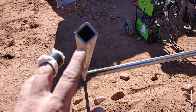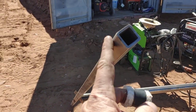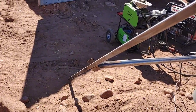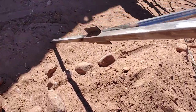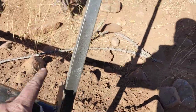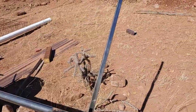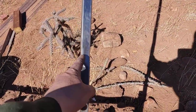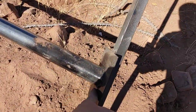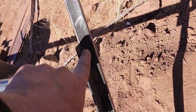This is where we're gonna mount the panels. We're nowhere near done yet — I just wanted to show some of the progress. What we did was cut this at an angle and welded a plate on here — all scraps, by the way. The six-foot length is actually three pieces that I welded together; you can barely tell. We welded the plate on first and then welded the square tubing to the plate, so it's welded all the way down on both sides.